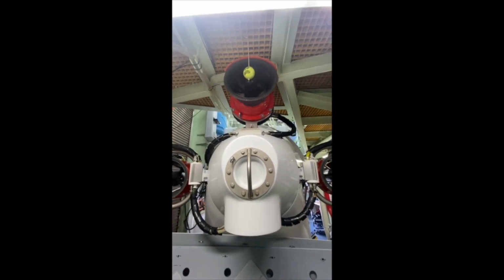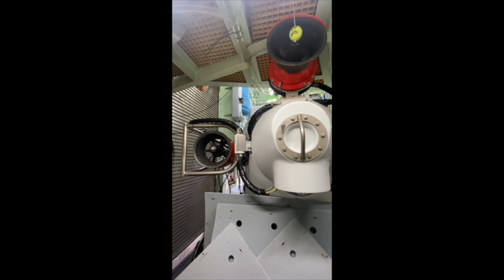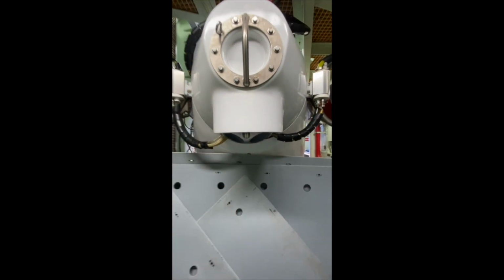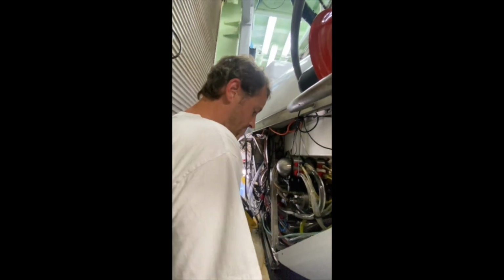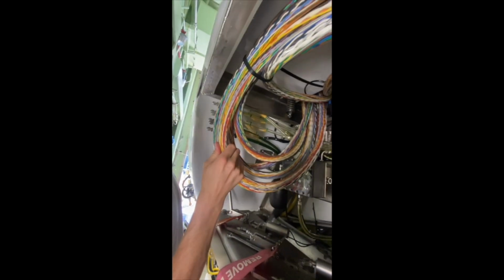In addition to some of the main vehicle systems, we also have a lot of instruments that have been changed out. The one that you see under here is the Doppler velocity log. That is part of our sub's system for inertial navigation and general navigation on the bottom. In its basic form, it acts like an altimeter, or how high are we off the bottom. But it is a pressure tolerant canister as well.